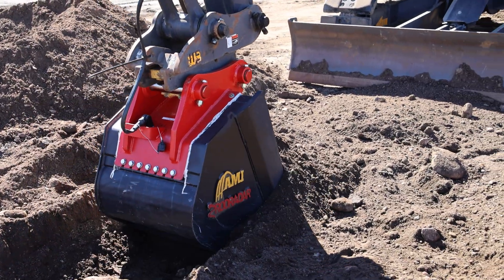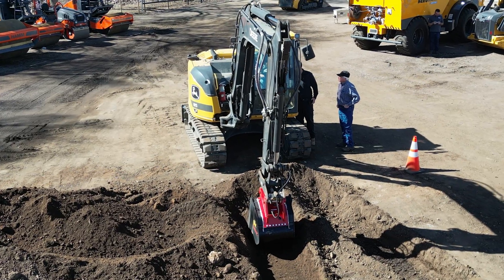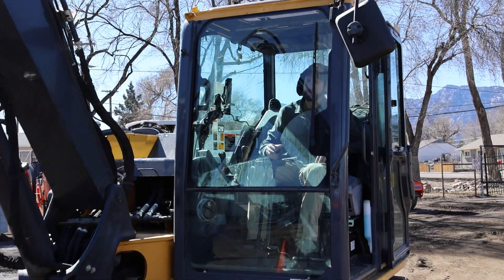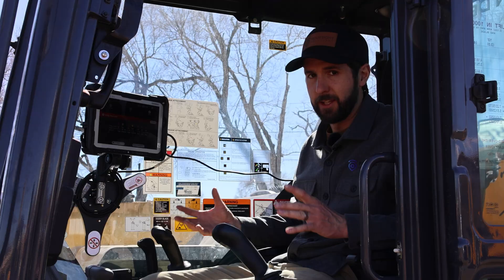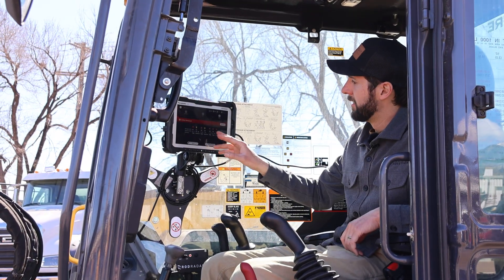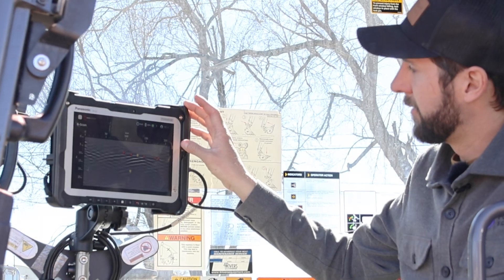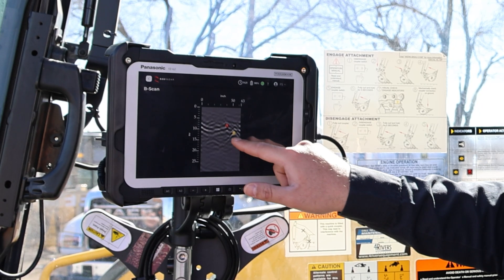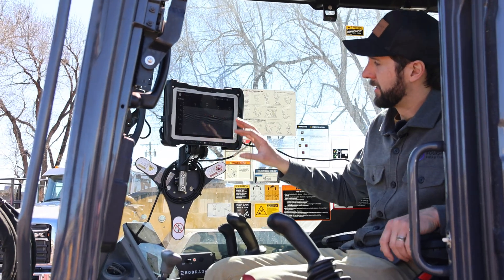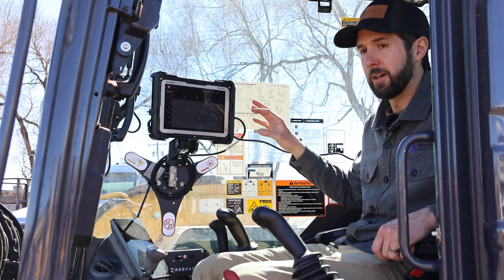You can go moderately fast — a good operator could go a little faster than me. Once you stop moving, you don't have to do anything else. It just processes the scan data and spits out what it's found on a graph. Anything solid that radar detection pings off gives us a measurement. There's also a second screen called the B-scan that gives us the raw data.